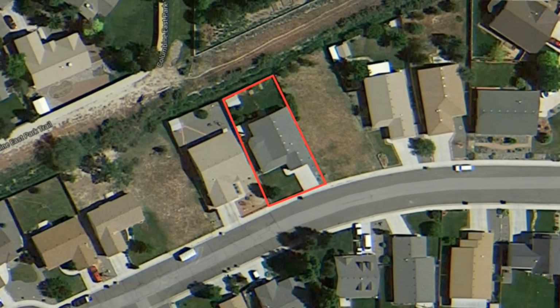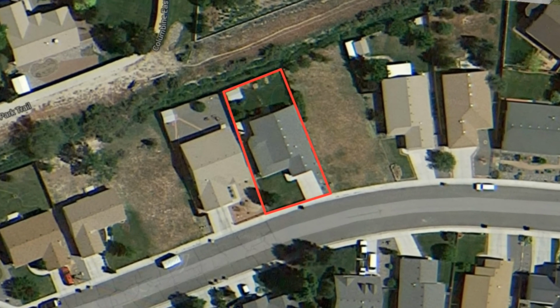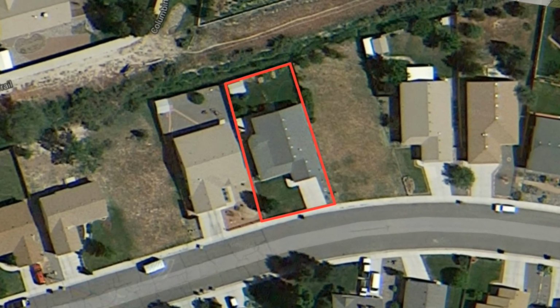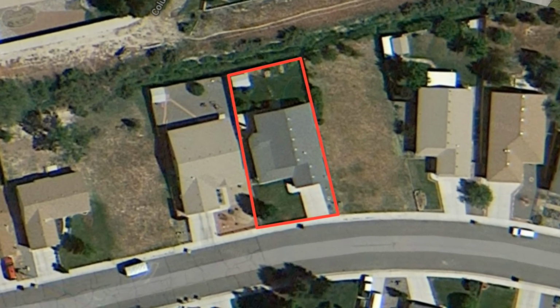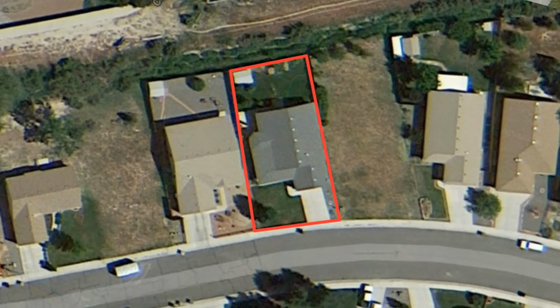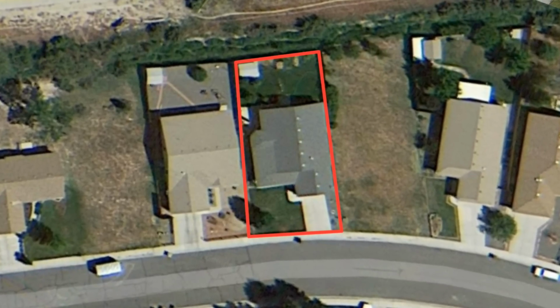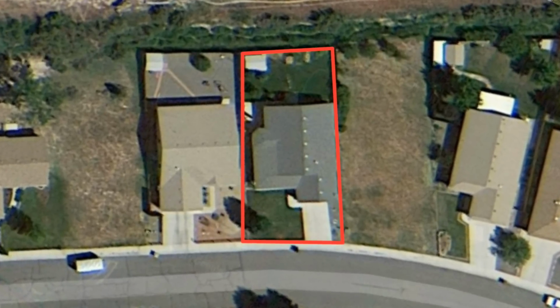I have a house that's sort of rectangular, longer one way than the sideways. So I put up a 40-meter dipole, standard copper wire dipole, running the length of the attic. And since it was not quite long enough, the ends of the dipole turn down and drop for about 3 feet on each end. But the dipole is going the length of the attic, and then across the width of the attic, I put a 20-meter dipole that just goes up the roof and up the top, then back down the other side. Both are connected in the middle and come down via coax to my garage and into my radio room here.